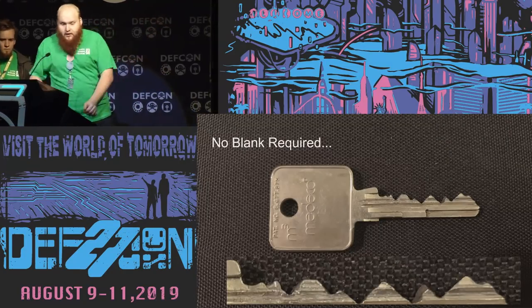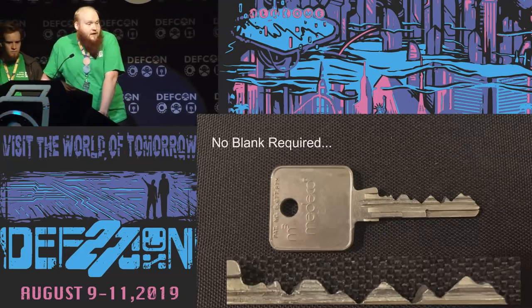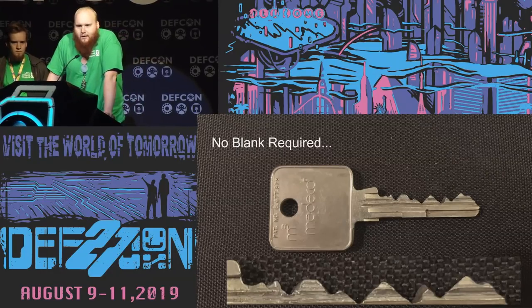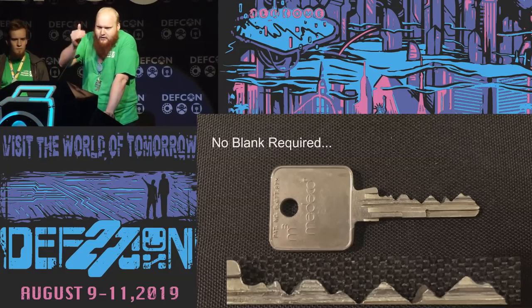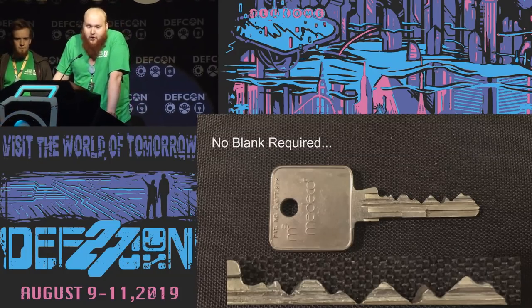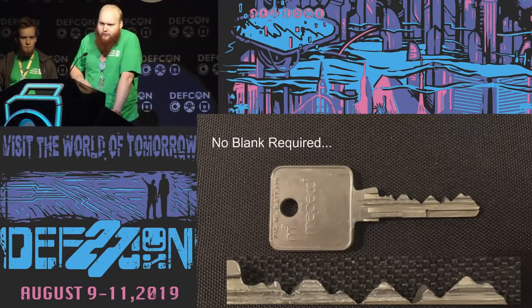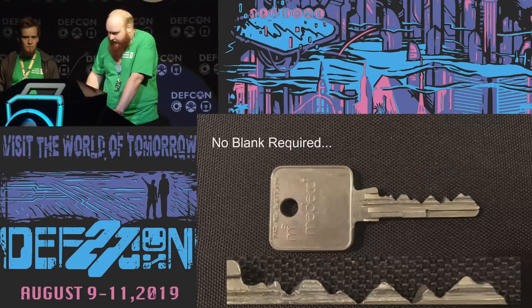So this one you see here, it's a little hard to see, so we have that close up in the bottom, but that's actually been added some metal to with simple electrical solder. Fits really well. You can get a good 100 uses of that out of that key before it wears down too much, because solder is very soft. But because it's so soft, it's real easy to hand file out the grooves so that it fits, as well as you can just stick it in the lock a few times and the lock will do that machining for you.